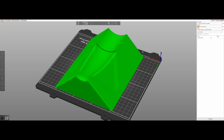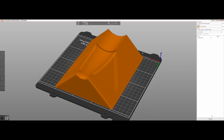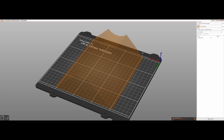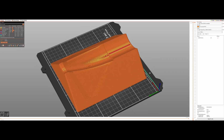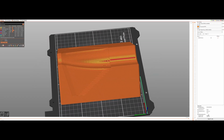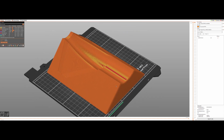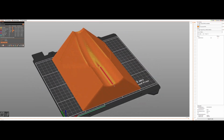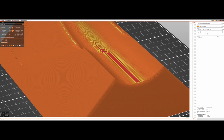Another trick to cut down on printing time: you don't need to be printing your infill at 0.1 millimeters. Prusa Slicer has a setting called Combine Infill, and it allows you to set your infill layer height to be some multiple of your perimeter layer height. With 0.1 millimeter layers, combining infill every 2 layers means that the infill itself is being printed at the perfectly reasonable and typical 0.2 millimeters. Big molds like this will take a long time to print, so it will actually make a significant difference in your print times to optimize the infill in this way.